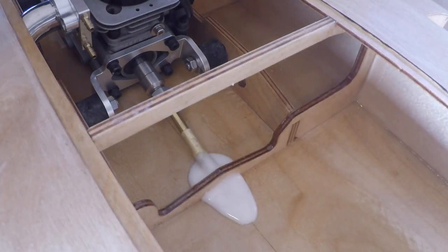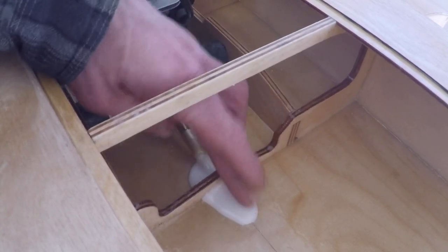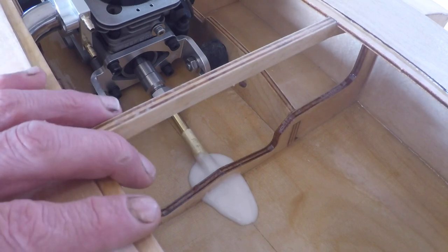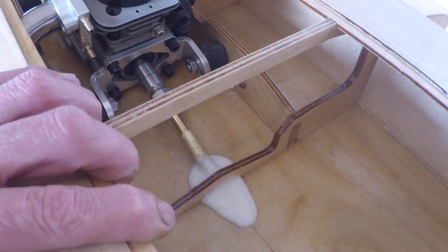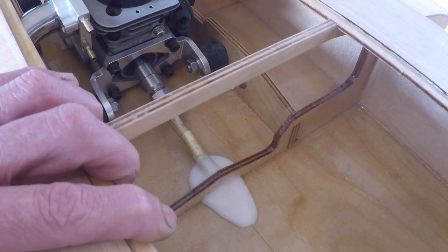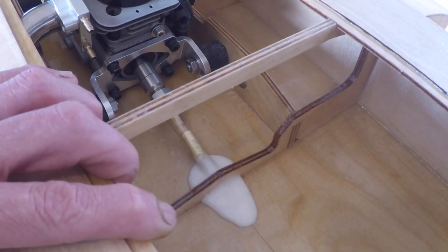Okay, guys. We've let our epoxy cure around our stuffing box for approximately 6 or 7 hours, and it's really dry to the touch, definitely not wet in any way. So, I guess the moment of truth right now, guys, is to lean in over the camera again and slowly slide our stuffing tube back out of our hull with very little resistance, just slowly spinning it back, and it's a snug fit going through the stuffing box itself. And it came right on out, no problem at all, which is exactly what we wanted.